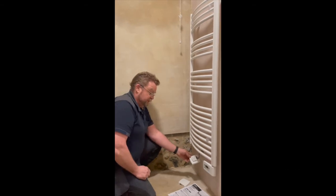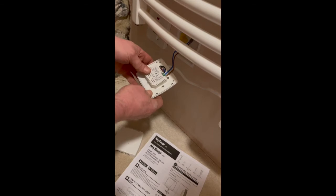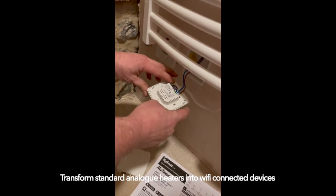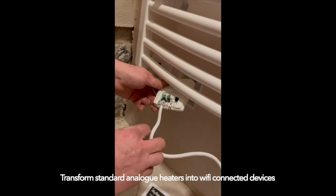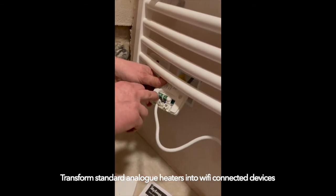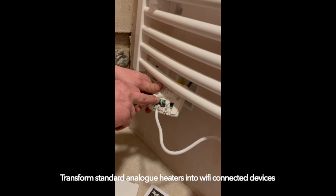The wiring on it is very simple to do. You have your normal switch fuse which your heater supply feeds into the MySense unit. You're just bringing live and neutral in because everything after that is double insulated. On the other side of that unit, your control wire from the heater comes in here, and you have live and neutral out to the heater. The black wire on any pilot wire controlled or enabled heater comes off the FP terminal.